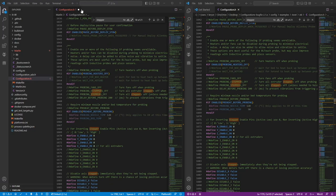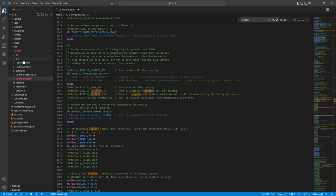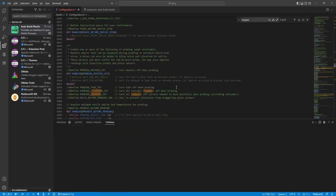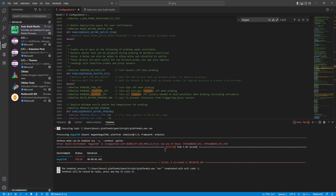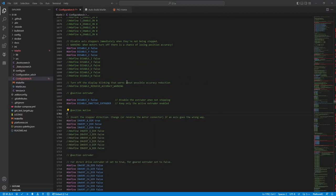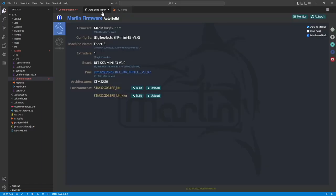So now you're going to want to go to your extensions. After you've changed everything you need to, go to your extensions, Auto Build Marlin. When you open Visual Studio, it should just pop open. We're going to save this quickly, or you can hit Control-Alt-B, and then it'll fail. Of course it will. Okay, I just had to reset something. So yeah, go to your Auto Build Marlin, and then for environments,